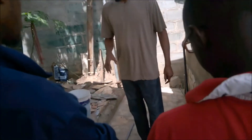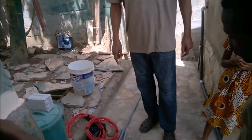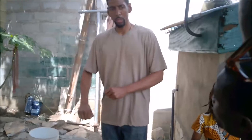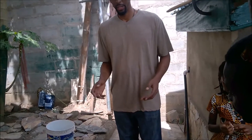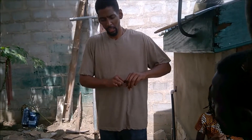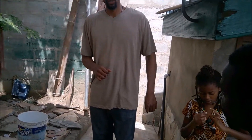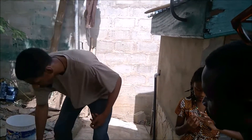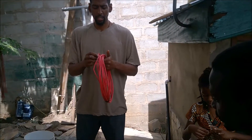Being that we're going to put this wire in conduit, we're not going to pull it through the conduit with a string because there are too many bends — it would be too difficult. So that means we have to basically sleeve each piece of conduit over the wire. The first step we need to do is stretch our wire out completely.